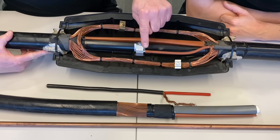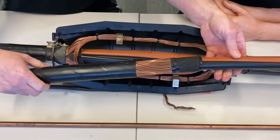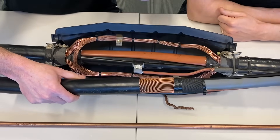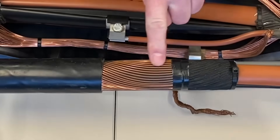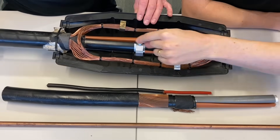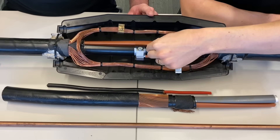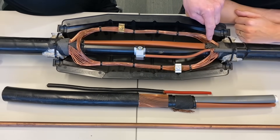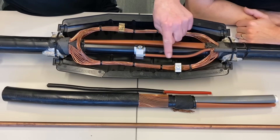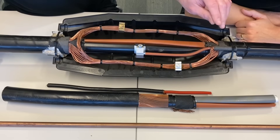They also didn't break the outside protective earth neutral. Looking at the cable design, it's not the convention of steel wire armour — it's actually been done by design, so when it's opened out you can pull it off the cable itself. It doesn't spiral so much as wave along. This copper conductor is our neutral and protective combined conductor. That's actually probably even more important than not breaking the line conductors — the fact that this solid copper conductor, which is our combined neutral and earth, has not been broken. That's remained a solid connection throughout.